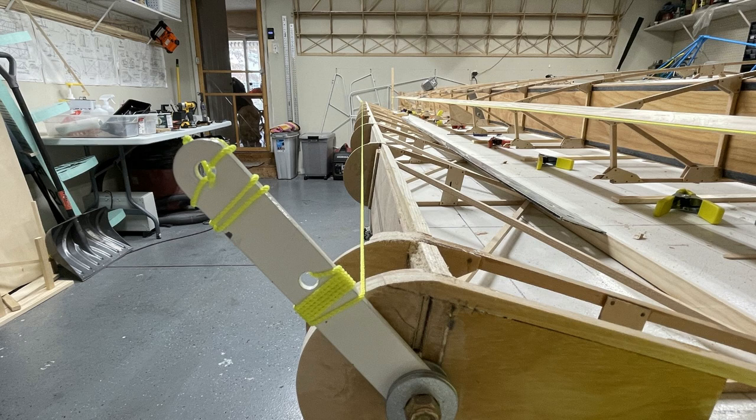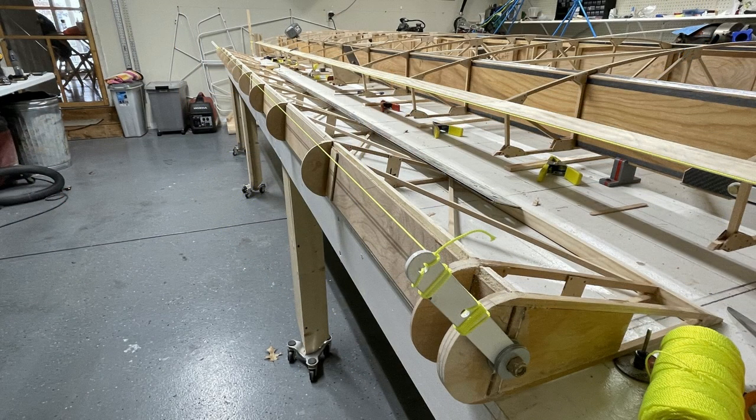This is pretty basic to anybody who's built model airplanes — we always see that in ailerons when doing this type of hinge, which I did on my MSL1 and MSL2. But I just want this to look right. One thing to keep in mind is that once you put the leading edge skin on this aileron, it's pretty much locked in — it becomes like a D-tube. So you want to make sure all of this is as straight as you can possibly get it.